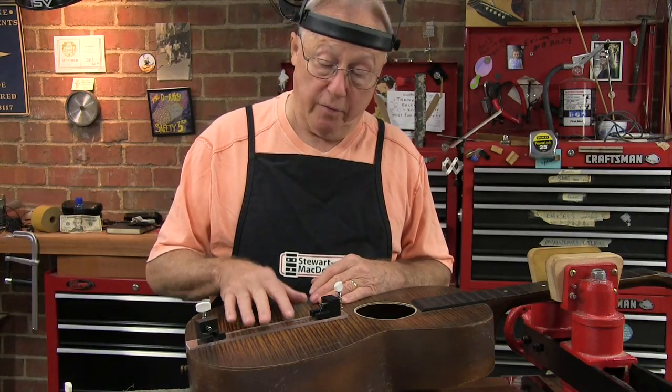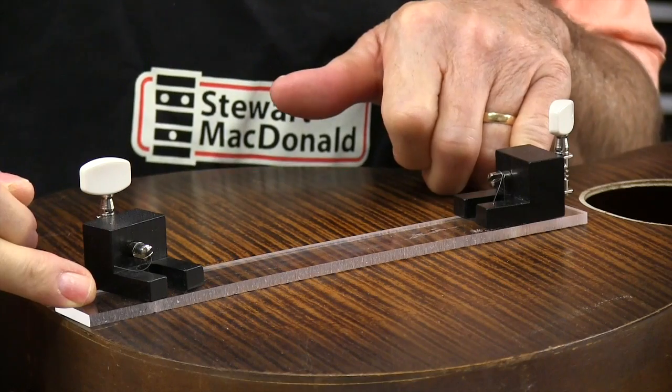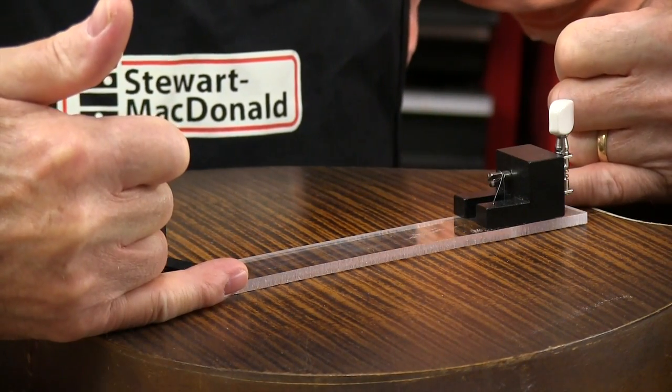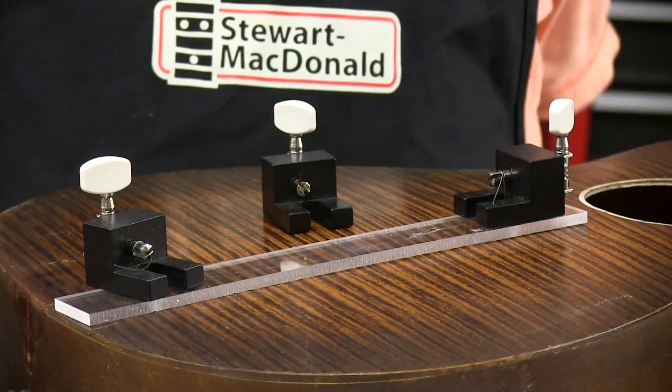What I have here is a piece of 3/16ths acrylic for a little extra flattening effect. I've got a hole drilled for my music wire. I have two different cracks going here — there's one here and one there, it's not one long crack. I don't always use a secondary caul like that; sometimes I'll go right on the crack with the tool itself.